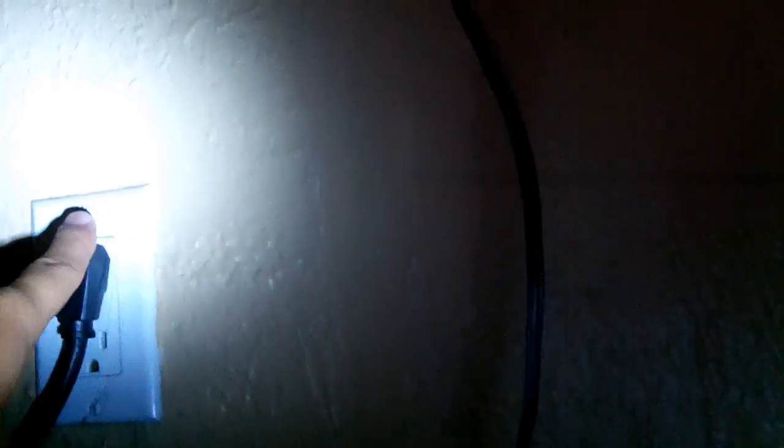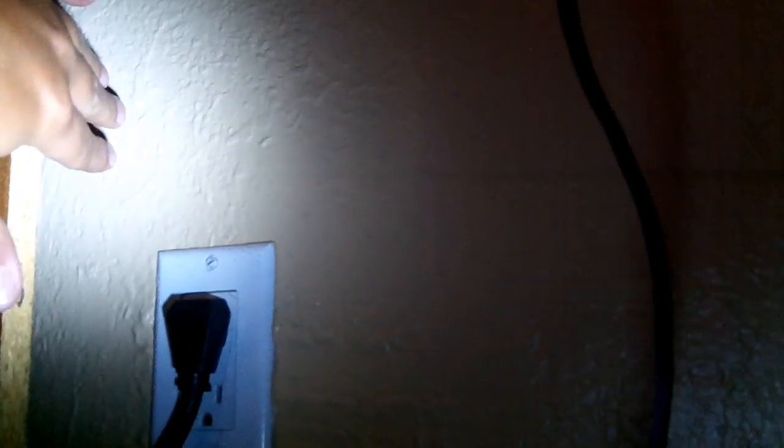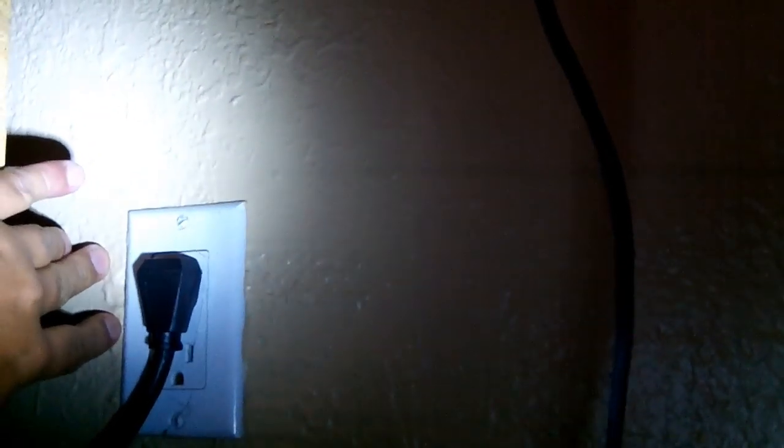We're below my desk and I'm thinking I want to put the jack in between this telephone jack and the power jack. You might even want to consider putting it over here, because you don't want your Cat 5 cable close to a power outlet — it should be about a foot away. I've already got out my stud finder, and there should be a stud right beside this.